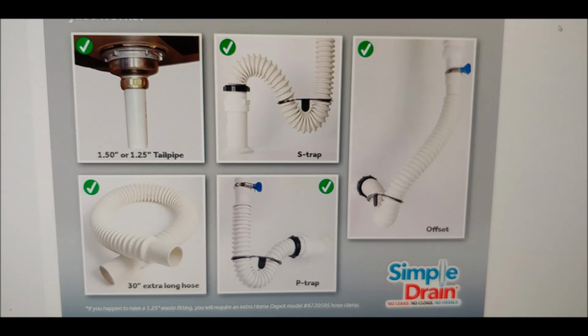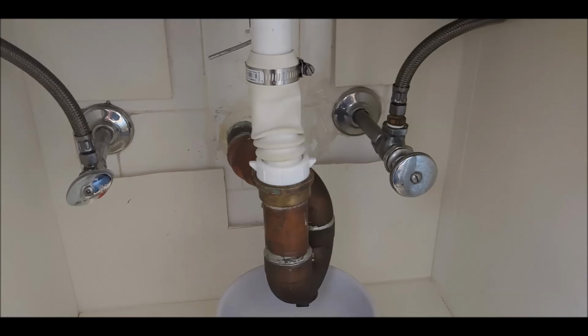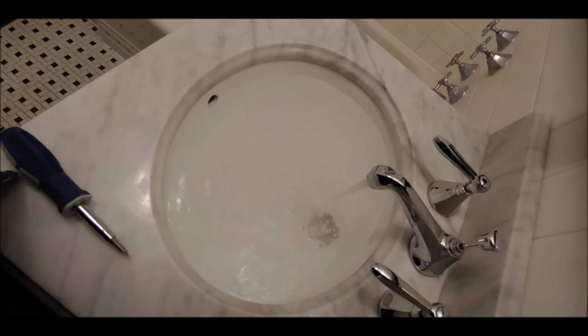I'll also have this in the description area of the video. You could see this is clamped down, and if you look very carefully, you'll find that it's off by those 2 millimeters. But for the short term, I'll have that in there. I also tested this out by filling it with water several times, making sure that the simple drain kept in place. In the longer term, what I'm going to do is fix the copper piping and make it a little bit more proper instead of using the simple drain. The simple drain's actually not up to code, but it's a good stopgap.